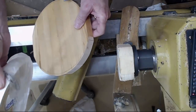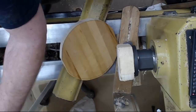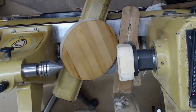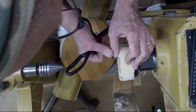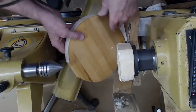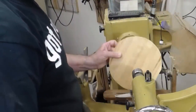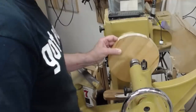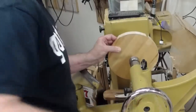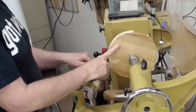You can get the turner's tape where woodturning items are sold. I'm going to bring up the tailstock and cut the corner a little bit to get that backing off. Like a lot of glues, the longer this sets up the better it is. I've already centered a hole here to register the tip. You want a clean surface on the wood — I've already wiped it down — and we're just going to let it sit for a couple of minutes to make sure it bonds.